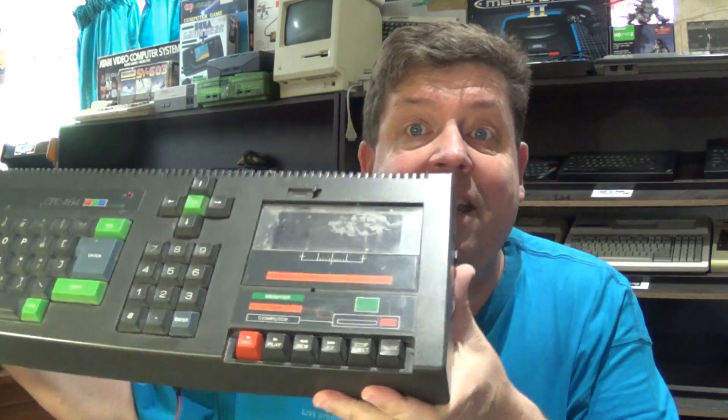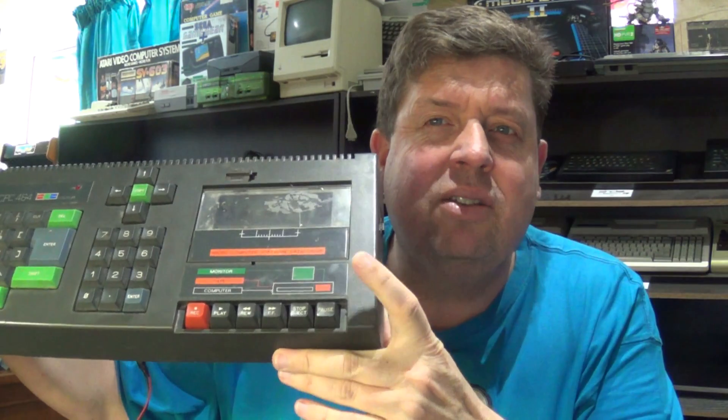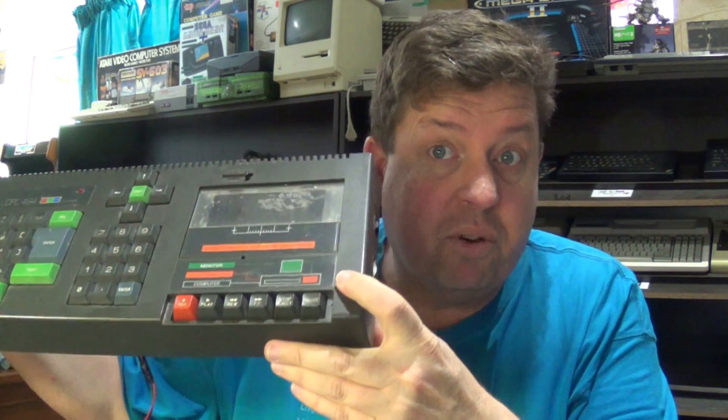The second option, and this is the one I'm going to be doing today, is actually adding an audio jack to my Amstrad — thereby not needing to use the heads inside. I still have to press play on here in order to activate the loading mechanism for the CPC games, but then I can plug it into my PC and load images from there or into another external deck. This idea came from another YouTuber, Mark Fixes Stuff — I'll put a link below because he's done exactly the same mod to his Amstrad 464, so I'm going to be following his guide. Please visit his site and thanks again Mark.